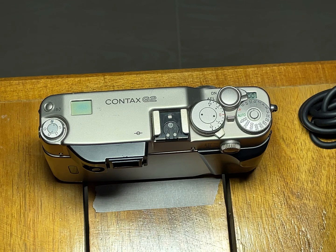This camera has two systems: passive autofocus and active infrared autofocus. I will show you how to adjust the passive autofocus, because usually the problem is exactly in the passive autofocus system when the camera misses object focusing. When the camera can't focus at all on distances closer than 3 meters, that is a faded infrared emitter in the active autofocus system — a different problem. Today we speak about exactly passive autofocus.